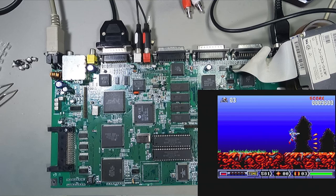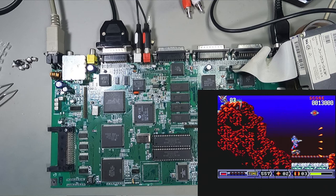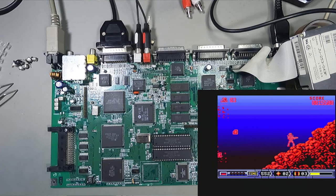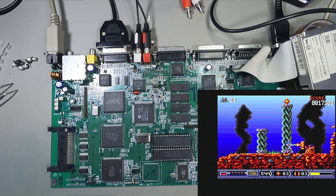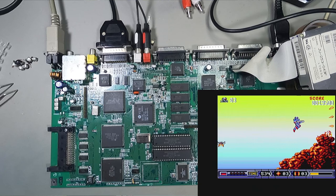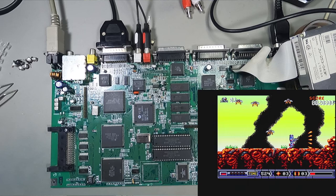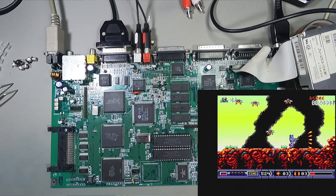It totally works! So there we have it — it's been recapped and I'm quite happy with that. I've successfully done it without screwing anything up. It's taken quite a few videos but still. Next job is to put the Amiga back together — put the keyboard connector back on, clean up the case, stick it all back together; I'll do that in another video. I hope you found it interesting, not putting all the caps back. I'm never going to use the RF modulator — I'll keep the caps in case I ever sell this or need them, but they'd be easy to put back. Less is more.